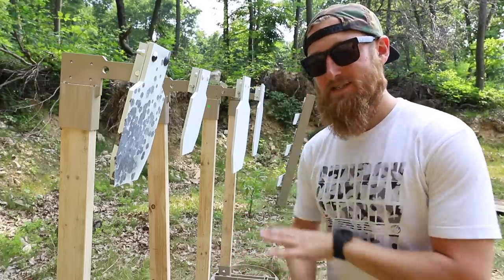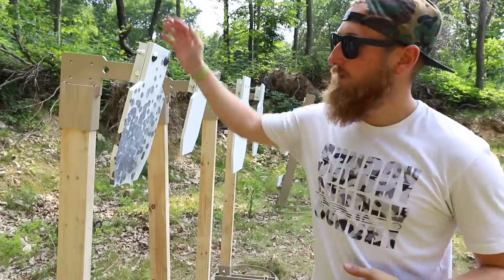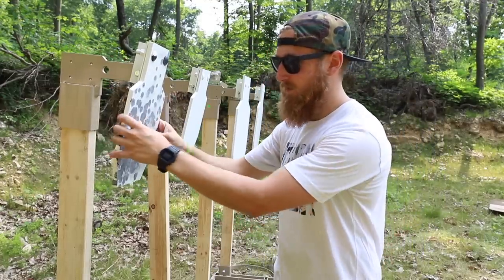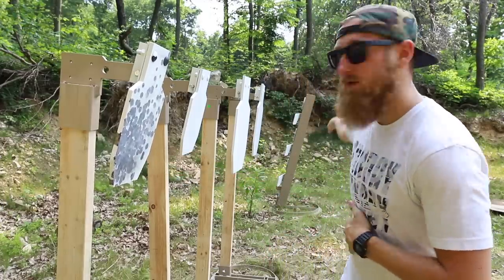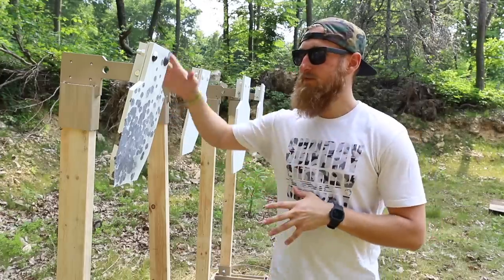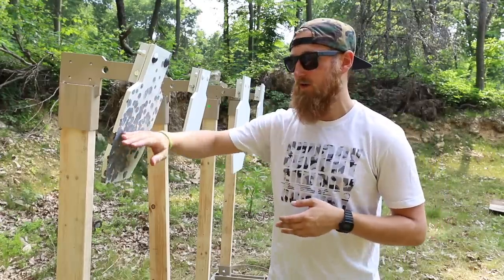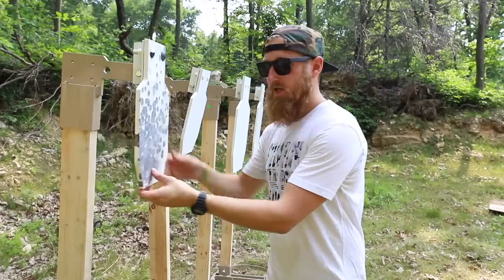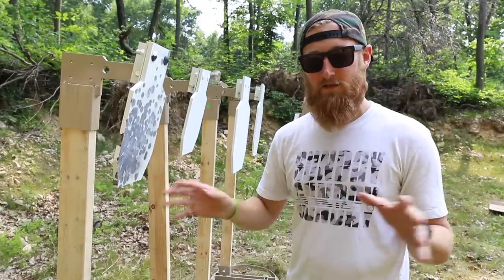One very important thing to note about these targets: I set them all up with no tools required. They're all self-contained in their own stands with just a 2x4, the head, and the target itself. The way this head is designed, there is minimal contact between the target itself and the 2x4 — they really just swing on this pin. Including the dueling tree, they are all at a nice angle so everything is fragmenting down towards the ground. Because of the minimal contact between the target and the base, the round strikes the target and then rocks it backwards, making it even safer so no shrapnel is flying back at you. Because there's a lot of steel with only one point of contact, these plates are going to resonate a lot louder than anything I've shot before.